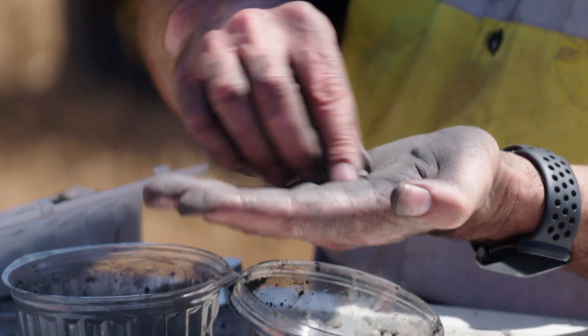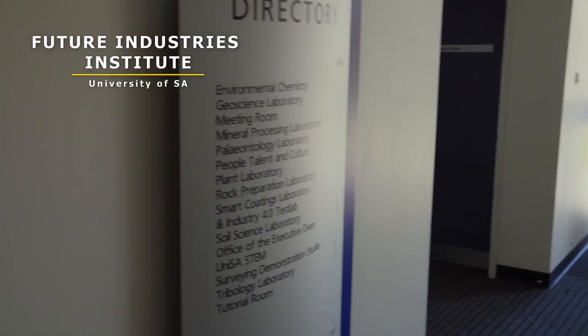With Sugarloaf though, the graphite is extremely fine, so flotation can struggle. The reason it's difficult to recover is that the fineness of the particles means they don't contact bubbles very easily. So you have to use strategies to increase that contact with the bubbles, and then you have to stop the waste from being recovered at the same time — that's where the optimization comes in.